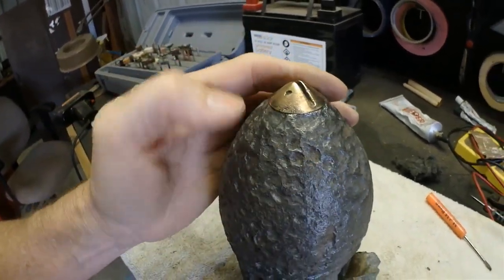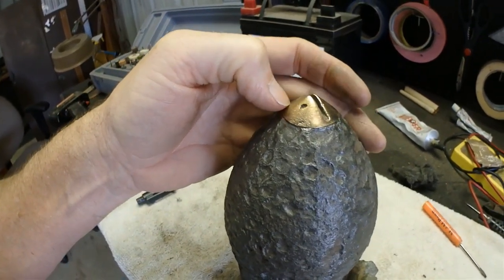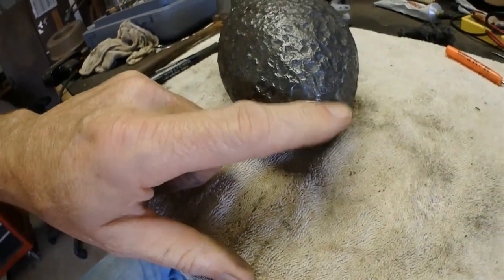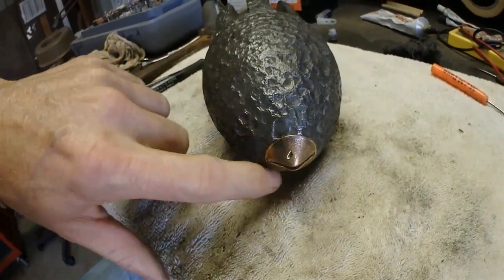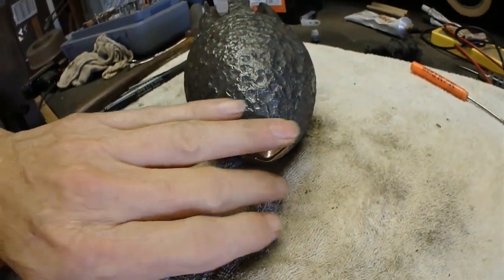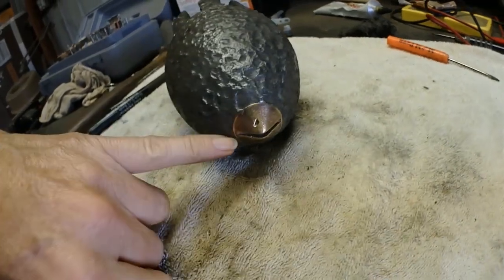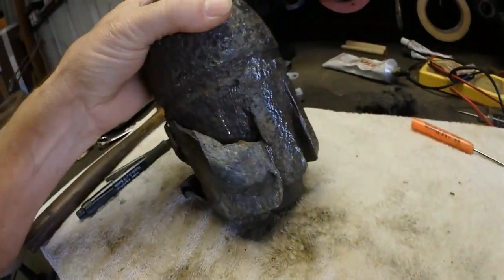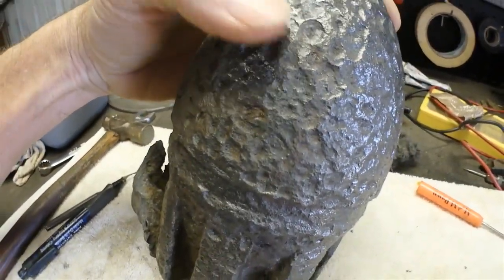What happens is, brass is an alloy, so sometimes the micro surface, I guess you'd say, I don't know the technical terms, you'll lose that very outer coating of the brass. It will erode away and leave the copper alloys, and that's why these things get real red. So you kind of have to buff it below that copper layer and get back down to the full brass mixture, so you get that yellow coloring back. So this one had to be polished because I didn't want that reddish brass colored cap. We've got the safety wire on this one, it's still showing, so that one cleaned up nice.